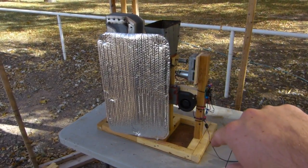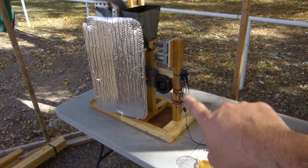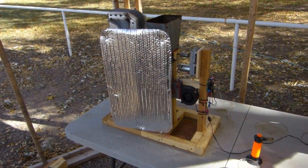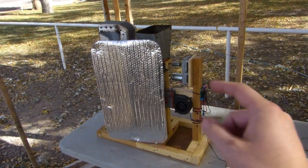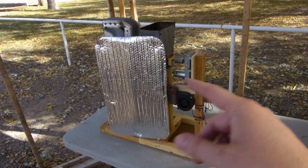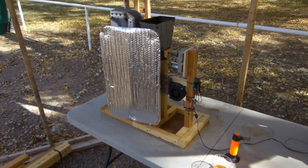I've loaded this up with four pounds of pellets right now and we're going to see the electronic control system work. It's going to be totally hands off — I've got it set for 15 seconds on, 8 seconds off. So it's going to be feeding fairly constantly, meaning we're going to get a big flame. Let's check it out.